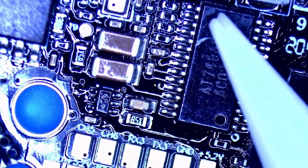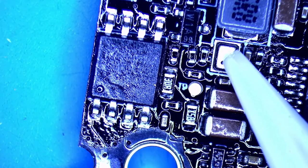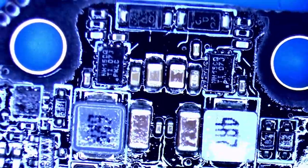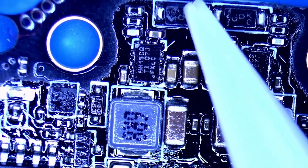Right here we've got our OSD chip. That's nice to see because if you are not running DJI you're going to run regular analog, and you've got an OSD chip right there - that is the full Betaflight OSD. Right over here we've got onboard flash, so you do not have an SD card slot - you've got actual onboard flash. That will store your information from your black box if you want to do black box logging. We've got a little barometer right here, so if you want altitude hold, return to home with GPS, it's nice to have that barometer on board. Right here are your two switching regulator circuits - from this TVS diode, around the inductor, around these diodes - all of this is going to be a switching regulator, split down the middle.